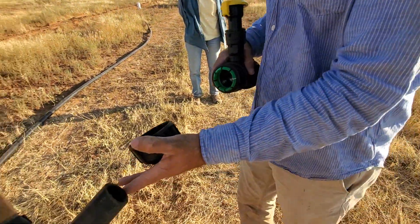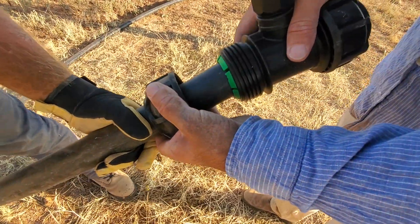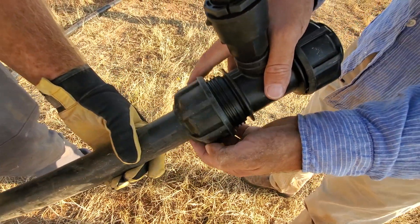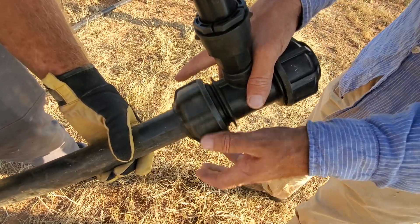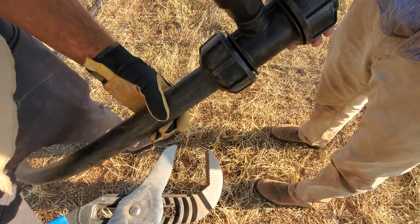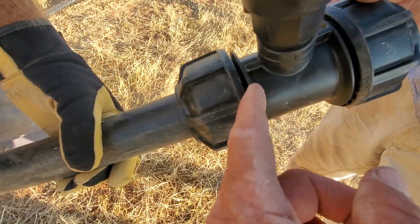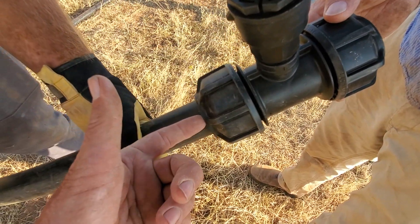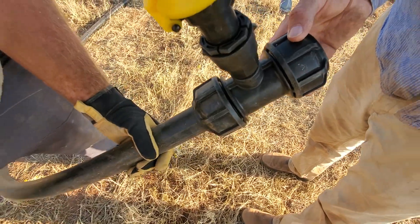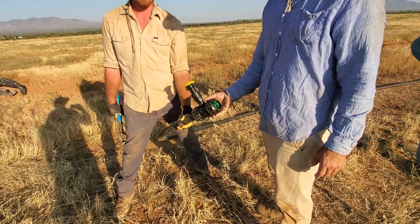Ricardo is going to slide this on. The big nut goes on first and goes all the way down as far as it'll go, then you tighten it hand-tight. Then take the plumber pliers and give it about another three-quarters of a turn — it'll butt right up against this sleeve right here. When you tighten this up, that's what clamps those polyethylene shims into the pipe so it can't come out. We're running 8,000 feet of this pipe on this grazing project.